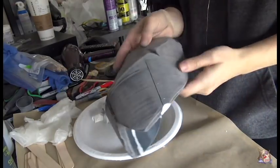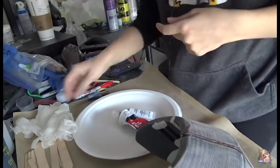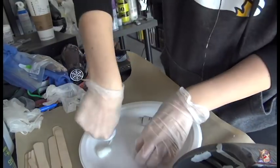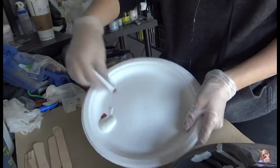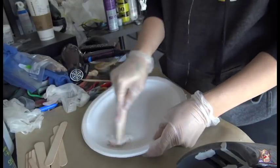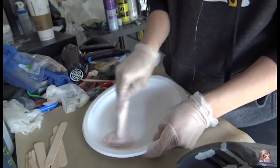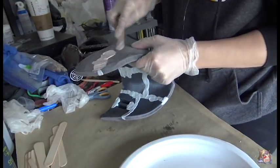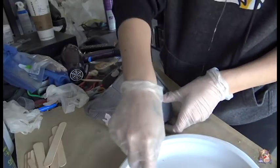We also have to fill in all the seams in the front, and for PLA, I love spot putty Bondo. Like regular Bondo, this sucker is two parts, but it is super thick consistency, so it's perfect for those pesky seams. Alternatively, you can try Acryl Green — I've been using that a lot recently and I also like it. The downside is, because it relies on air to cure, you cannot fill it in as deep as you can with the two-part Bondo. Maybe try and mix both — maybe you'll like it.